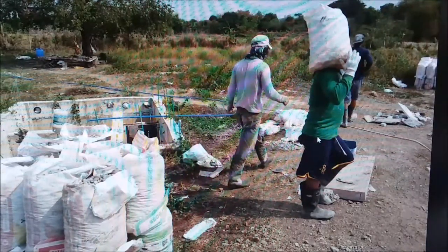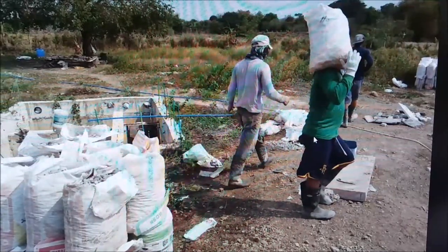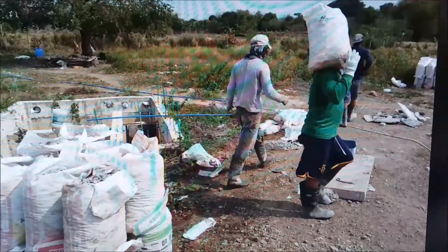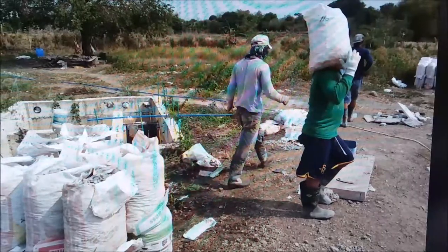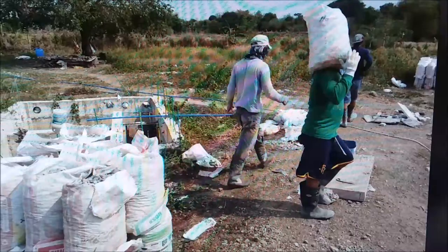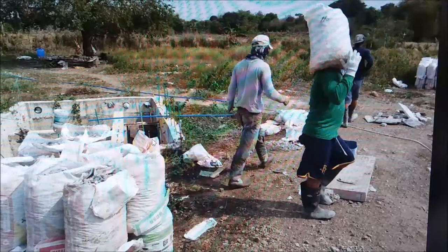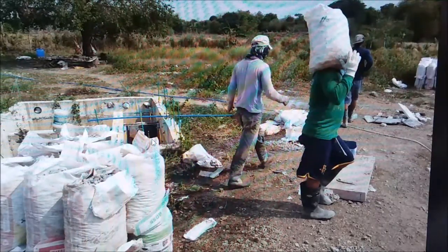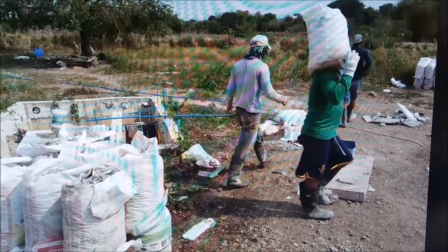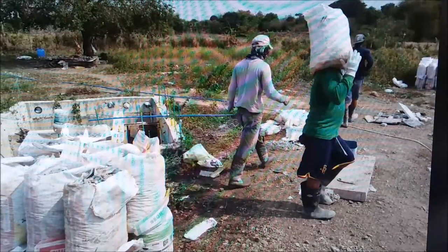He's not supposed to be carrying bags — he's one of the two that aren't supposed to — but there he is, caught him in the act. And they're over by the septic tank with no lid. These are the air vent holes on both ends; there's about a 9-inch space between this and the lid for air circulation. The walls are different heights to direct the air in where we want it and out where we want it. If you've got enough air in your septic tank it doesn't smell and doesn't build up with solids — the enzymes in the bottom take care of it. It's a true septic tank, not a cesspool pit.